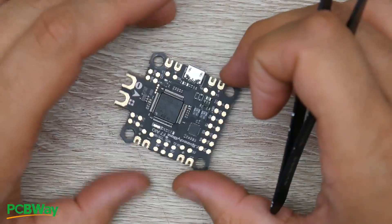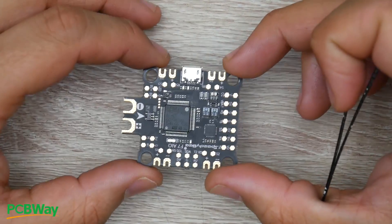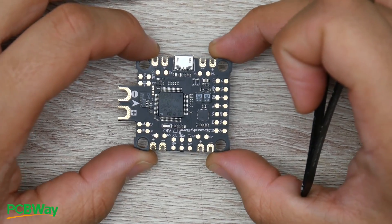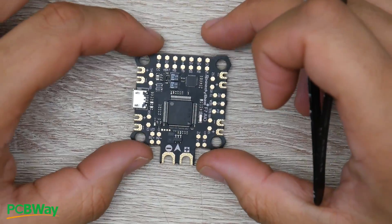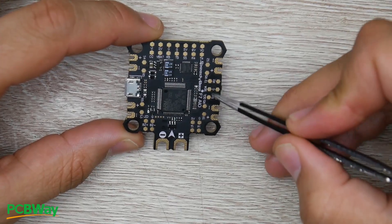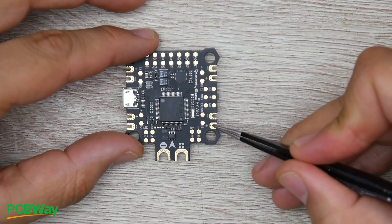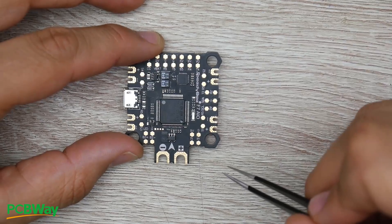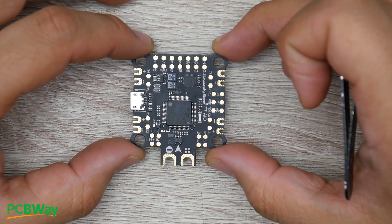Keep in mind: if you are using a 4-in-1 ESC, this board needs battery voltage — do not give it 5 volts or it simply won't boot. Nothing bad will happen, it just won't boot; it needs battery voltage because of the 9-volt regulator. Everything is linked down below — if I missed something let me know in the comments. Overall the execution looks really great; pad spacing is very good, especially for newcomers, though the positive and negative battery pads are a bit close to each other. Hope you enjoyed the video — see you in the next one, peace out.